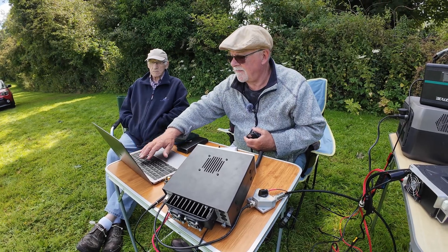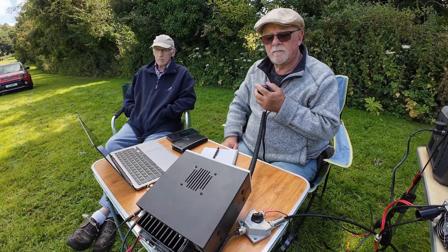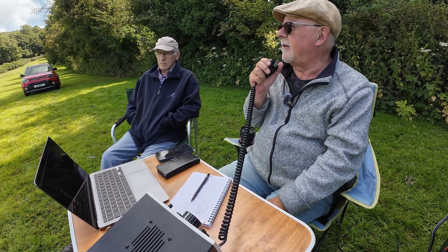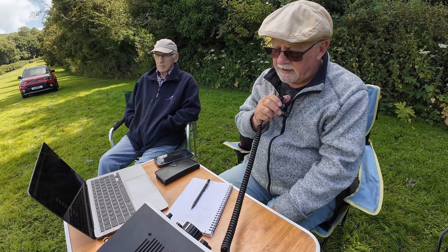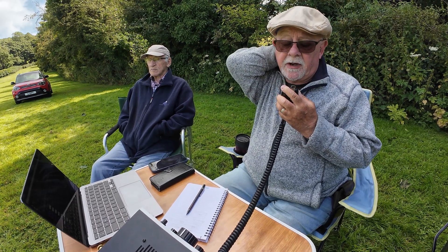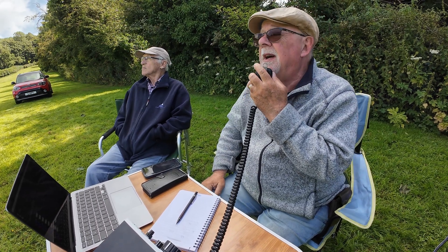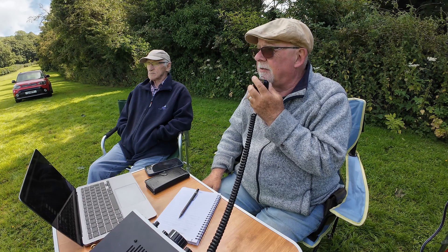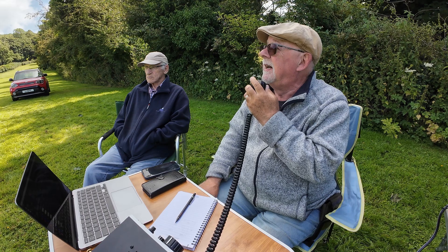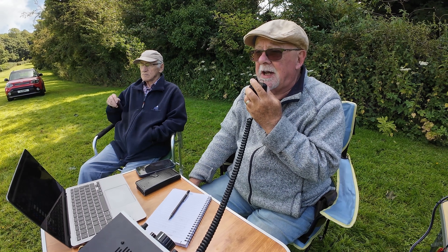I think your signal report on the next one, old man — GX5BAY, five and nine from here. GX6ZME, GX5BAY — yes, fine on that, very nice to meet you John. We're running 50 watts now; I've changed antenna, I'm on the dipole now — I was on the end fed before. The band is rather up and down so it's difficult to be sure, but I think both aerials are making a good name for themselves and they seem to be fairly equal.